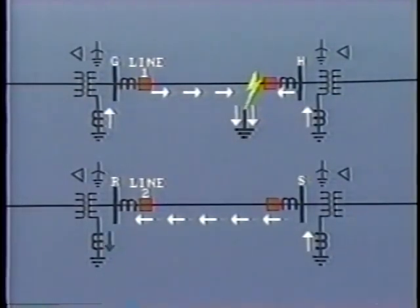Well, even though fault current passes down the neutral, it will still allow tripping because the current flow through the line is in the out direction at this point. Therefore, the two breakers on this line may be tripped quite incorrectly because of a fault on the other line.